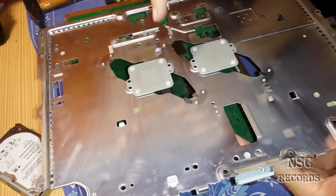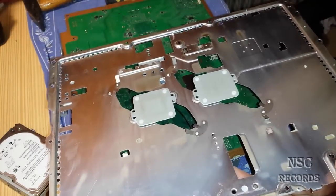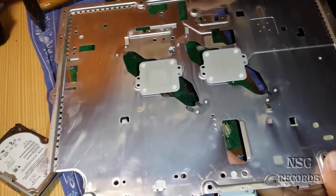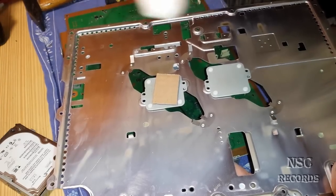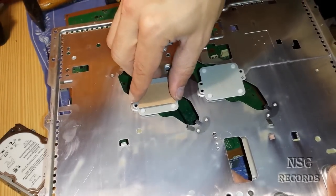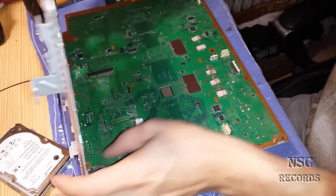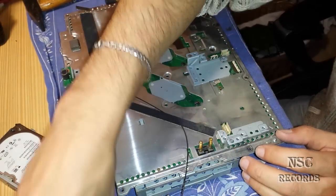You just do that if you have still problems with the pressure — like on this video here, you will see a CPU that had not enough pressure. First try the option with Arctic Silver 5 inside the heat spreader and I promise you guys this will work just fantastic. But if you have a chip that is still working perfectly, you don't need it. You just do it like I said if you don't have enough pressure to the chip.